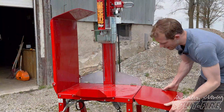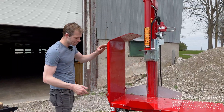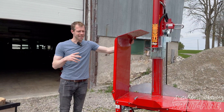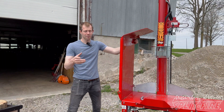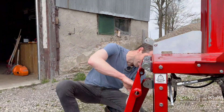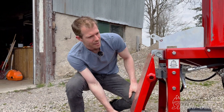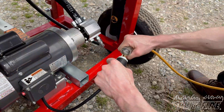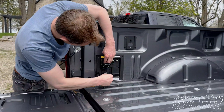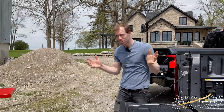We'll get it set up here and be good to go. Just keep in mind this thing comes with a heavy gauge extension cord that is a 25-footer. Anything to do with electronics — the longer the extension cord, the more amps it's gonna pull. So it's important to use the extension cord we provide. If you do need to go with a longer extension cord, just be prepared that it might pull too many amps and you could end up tripping the breaker. Our 1165 is ready to go. It's pretty simple: plug it in, turn the truck on, hit the green button. When you release it you'll hear a slight click, and from there it should be as simple as firing up the splitter.